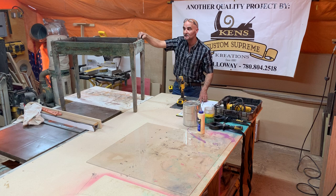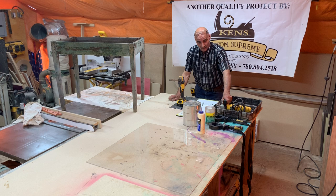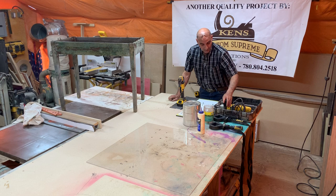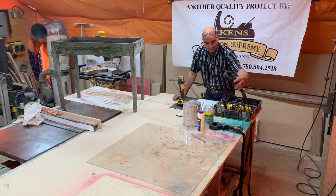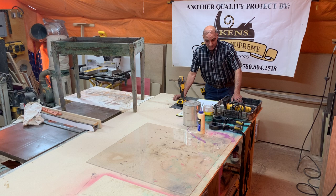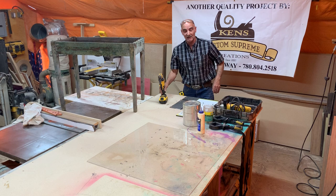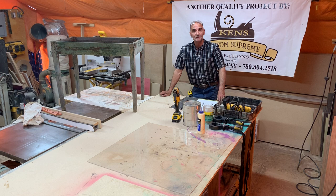I'm going to be biscuit joining together the miters. There are not going to be any nails or anything used in this. I've got number 10 biscuits, my biscuit joiner, and strap clamps for putting together square boxes and stuff like that, where sometimes it's hard to use regular clamps. And I also got this piece of plexiglass here, which I'm going to be utilizing for the glass. That way, if the pictures ever fall down, at least the glass won't break. That's what I decided to use anyway.